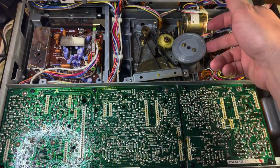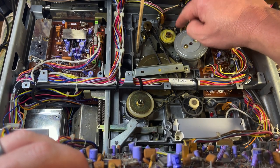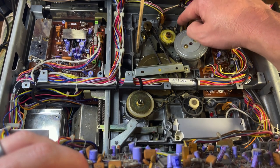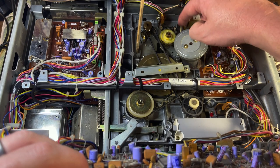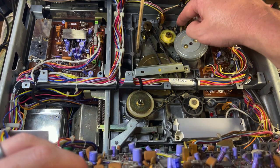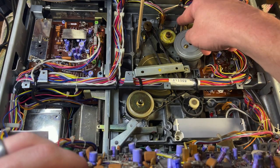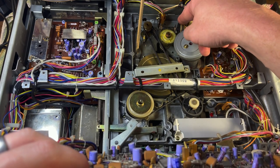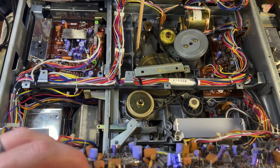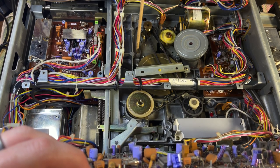And if we look right here, this is what goes to the video head — there's no belt around it. So I'm now manually spinning this motor, which should be setting the take-up track. My goal is to see if it just needs to be reset, if it's not in the right spot, if it got stuck in a position where the machine doesn't know what it's supposed to be doing. I'm manually rotating it all the way to the end until it stops, then I'll power it on and see what happens. Okay, looks like I've gotten to the end — when it starts to get a little tight you better stop or you risk breaking the plastic gears. Now I'm going to power it back on — hey, that's what I wanted to see!